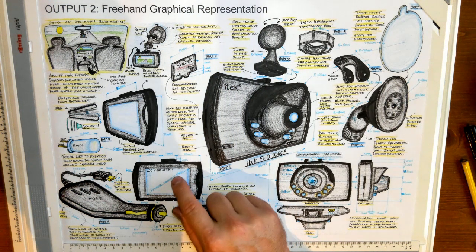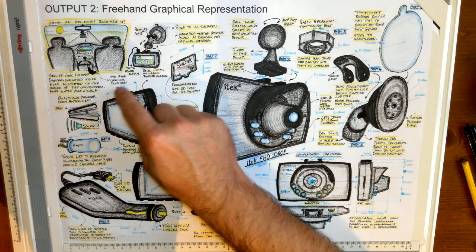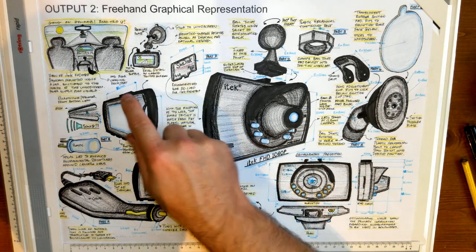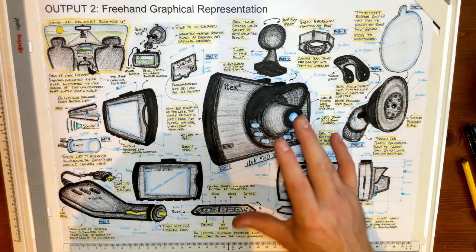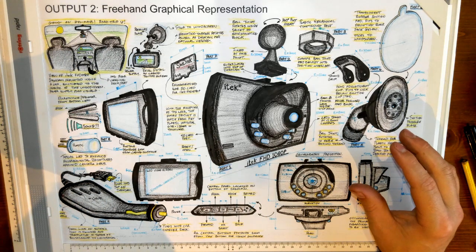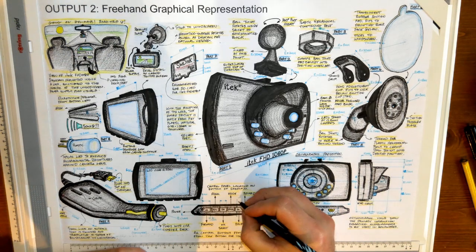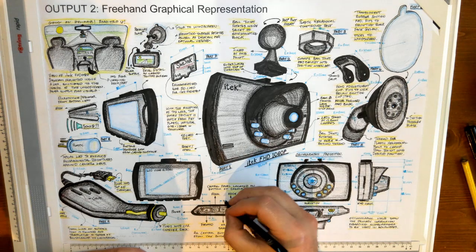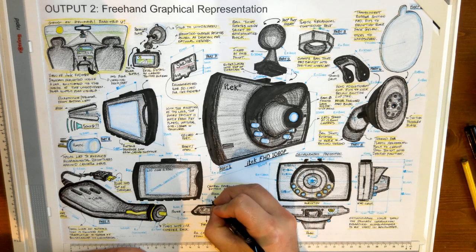I've noted the screen length — or the diagonal length — which is 60 millimeters, and I have the screen dimensions for length and width noted as 52 and 32. All that information is there. From that I have the basis now for actually going ahead and creating a SolidWorks model from the parts. I have a couple of dimensions: that's 4mm, that's 6mm, and 6mm right there.